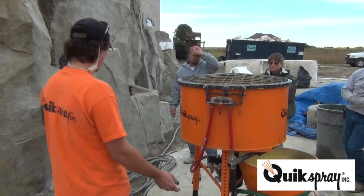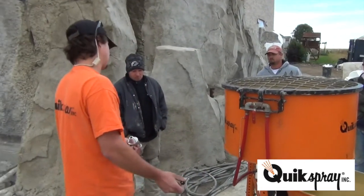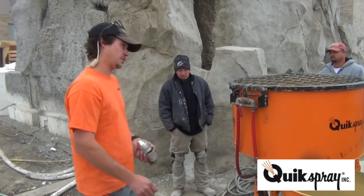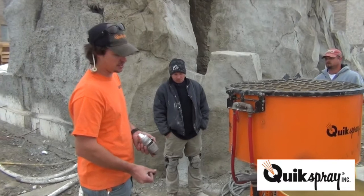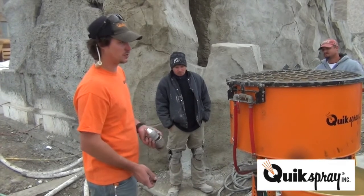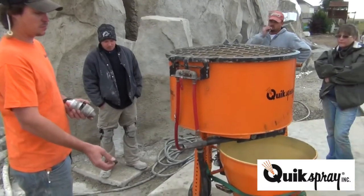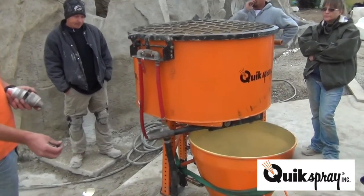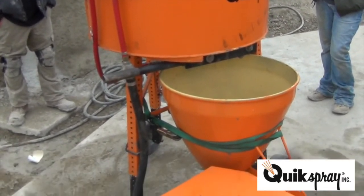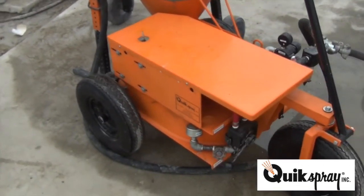Maintenance issues are pretty much none. The only wearing part is the hose, and I recommend taking the hose out after you're done using it, or if it's going to sit for a month or so. There are three wheels inside and the hose is always going to be crushed by one of them, so leaving it in just wears out your hose. I personally like to see it pulled out, with silicone lubricant applied — no petroleum-based lubricant on the hose. Re-lube it every 40 hours or more, and anytime you take the hose in and out.